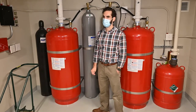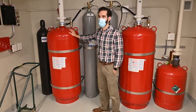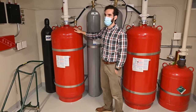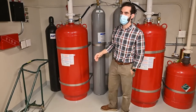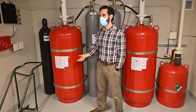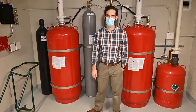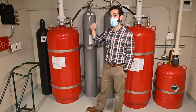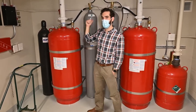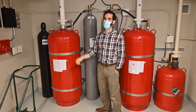What's the black tank over there? These tanks were a little low when we brought them in, so that's some nitrogen we used to pump the pressure back up. When these are shipped and agitated, the Novec can mix with some of the nitrogen and that reduces tank pressure — so standing operating procedure is to pump a little more nitrogen in to get it up to 240 psi. They each have pressure gauges and are hooked up to alarms, so if they're depressurized for any reason, they'll send a supervisory signal back to the main control panel.